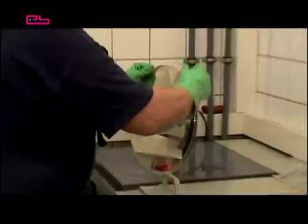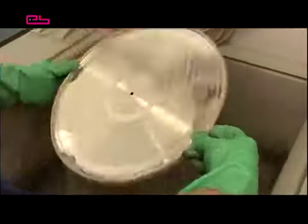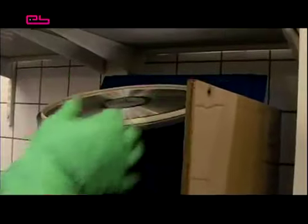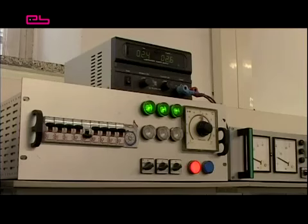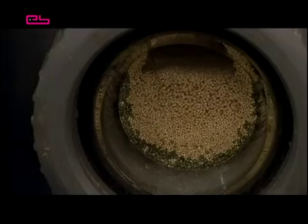The foil is now brought to the so-called pre-electroplating. Beforehand a rubber ring is put round the edge. This will ensure that the nickel coating which has developed during the electroplating process can be easily separated from the foil. Now the foil is dipped into a nickel sulfamate solution. An electrochemical process takes place. Here the cage with the nickel balls inside is the positive pole, called the anode. When subjected to DC current, the nickel ions migrate to the silver plate, the cathode in this case, and accumulate as a metallic nickel plate. In the pre-electroplating bath, relatively low amperage and temperatures are used. With higher amperage, the nickel plate can generate internal mechanical tension which would possibly distort the groove of the foil surface.